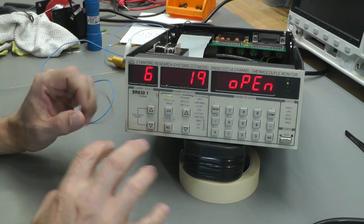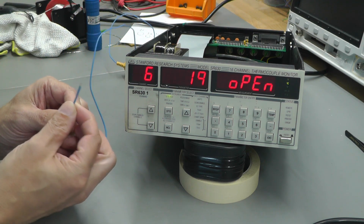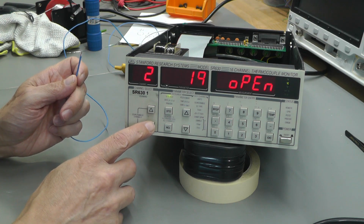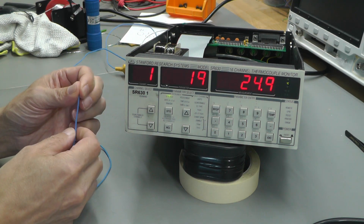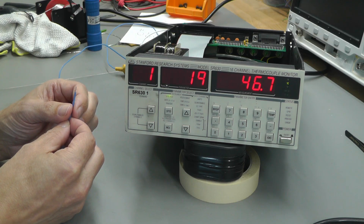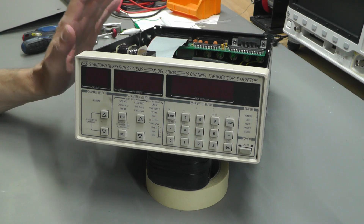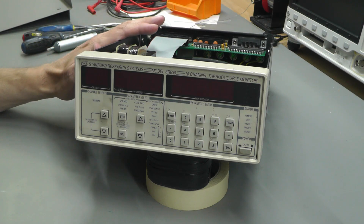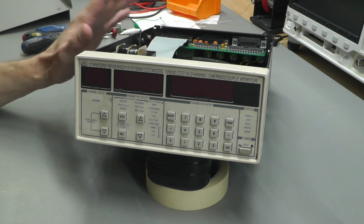Let's see if the unit actually works. I've hooked up a thermocouple to channel one at the back, and I'll go down to channel one. Yes — 25 degrees! Let me put my finger on the end — yes, it's working! There are some clicking relays — not sure what that's doing. Well, it's just failed again. This time it didn't trip the workshop RCD — it tripped the RCD in the house, which blew out the whole workshop. I've reset everything. We still have a major problem with this instrument, and I don't think it's the power switch again. I think it's the line filter breaking down and tripping the RCD.